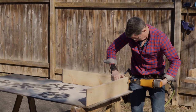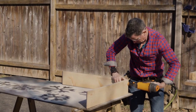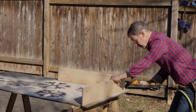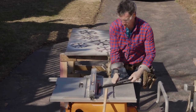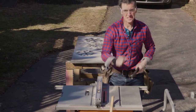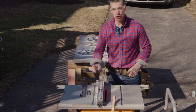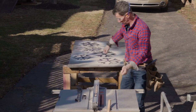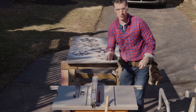Keep my hands clear, and here we go. Two quick things about this cut. One, the piece is an inch wide, so to me that's push stick country. Two, when ripping a long board, it's sometimes nice to have a work table behind you to get it situated while you're getting it started and pushing it through the tool.